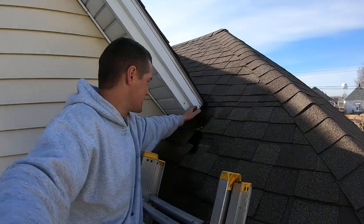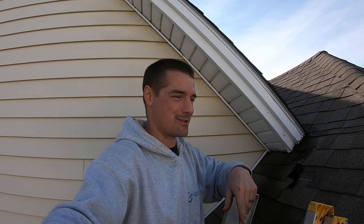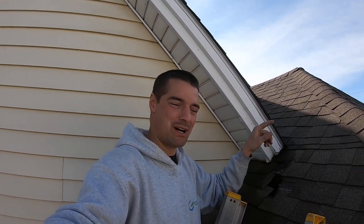If you are going to proceed with roofing over at your house, add flashing at your wall and add a new pipe boot — or save the existing pipe boot to save a few bucks. All you've got to do is take the bottom of the pipe boot loose, tuck your new shingle under, lay it back down, shoot it off, and continue on your merry way. That's all you've got to do.